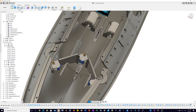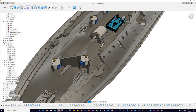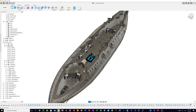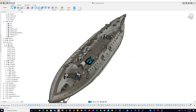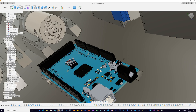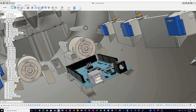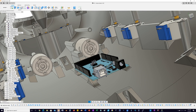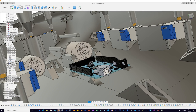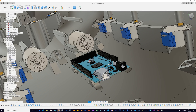12 turrets is just about what an Arduino can possibly handle — it can maybe do a little bit more, but that's enough for this boat. If I put the gun groups back in, you can see that each one will sit down into the actual stepper as its lower pivot, and so when the stepper drives it left or right, the turret will turn.